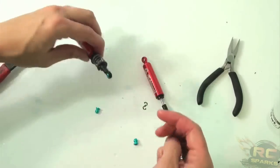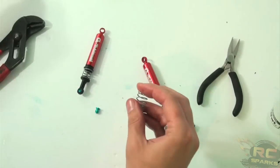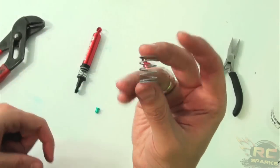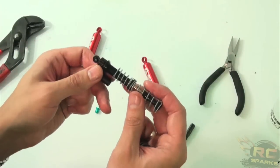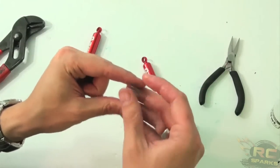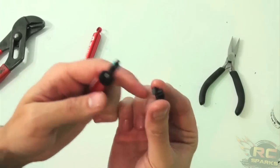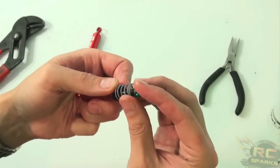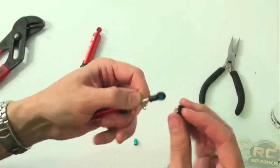The modification I'm doing is adding this extra spring. Just to make sure it's all removable at any time, I use two of these ends and I get this red spring — straight from the stock Axial shocks that are already two-stage. It's the top spring, so it's a perfect firmness for what I'm looking for. Something this simple: take the rod end, and I'm going to have it pointy side down. The reason is so it can easily feed itself back in when it's at full extension and then comes back down.